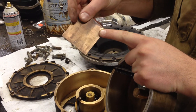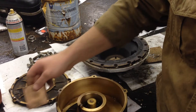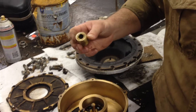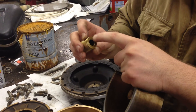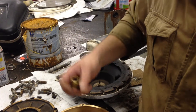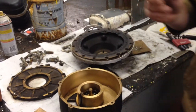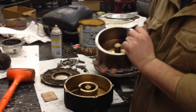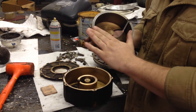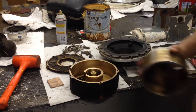I don't know if you can see the scratches in that. It also has this bearing that it rolls on. This surface has a lot of lines buried into it from dirt and grease and stuff, along with the shaft. So we'll probably do a little bit of machining over in our machine shop — clean the bearing inside, the shaft, clean up all these edges, maybe fly cut it, polish this inside so it slides nice and smooth inside there.